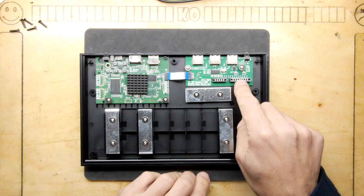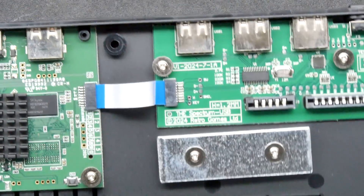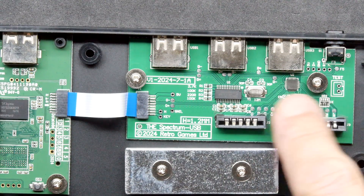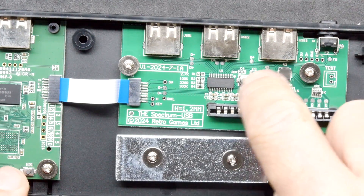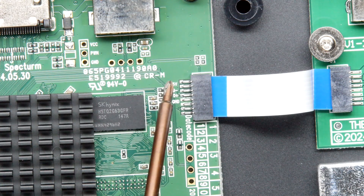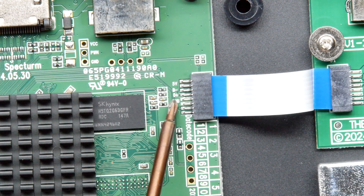What you have here looks suspiciously like a USB hub, and the reason I'm saying that — if we zoom in, there are two giveaways. One: it has a USB host controller from the look of it, because it has its own crystal and various electronics. And you can see there is an additional button there that you use to enter a certain mode mid-game — that's the home button. And then looking through, on the PCB you can see your USB pinouts.